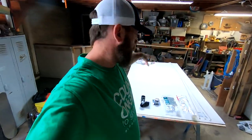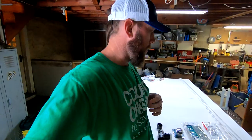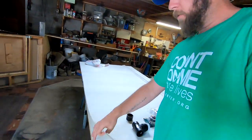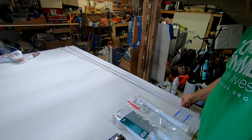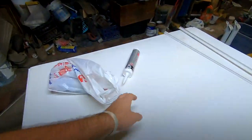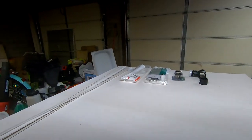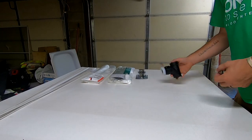I'm going to show you the parts here in the garage so I don't cover anything up in the small bathroom. I just got back from the hardware store because I missed a few things on my last trip. I think I have it all now. We're going to FRP the walls and I got corner trim and end cap trim for it - it's been sitting a while, that's why it's dusty - and then new sealant and construction adhesive specifically for FRP panels.